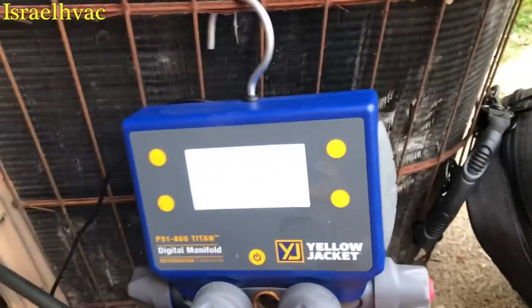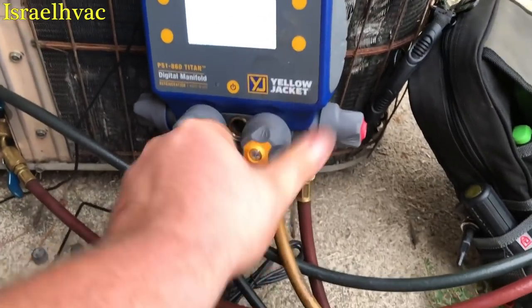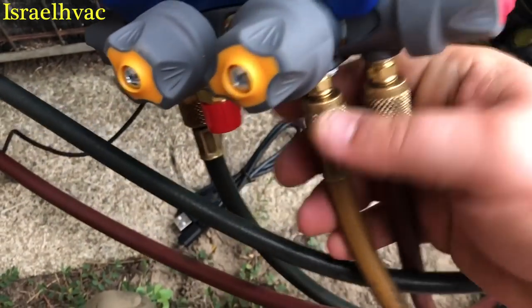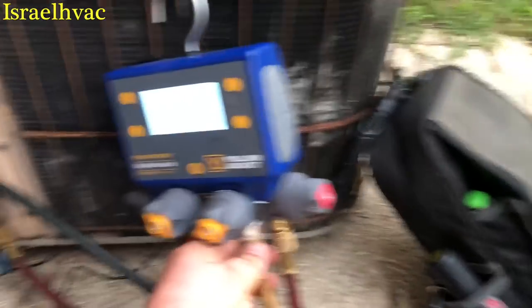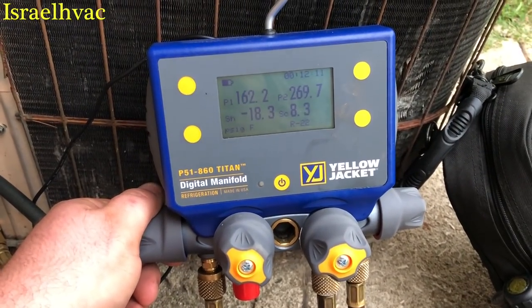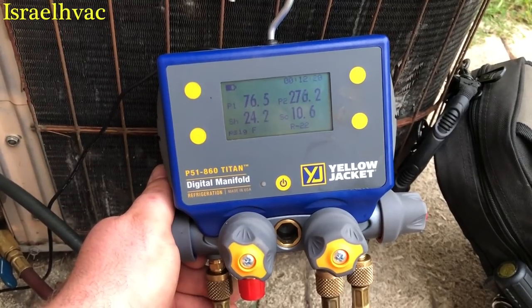The target is 5; I'm going to bring it to about 10. So I've got the liquid line set up here. I'm going to open this one up. This is a 4-valve manifold. Even though I'm not really a fan of the 4-valve manifold, I think it's the only way this one comes — it's not that big of a deal. We're going to bleed this one and add some gas. Let's turn that backlight off.